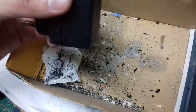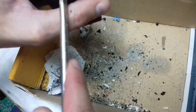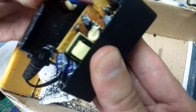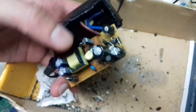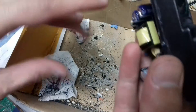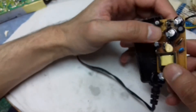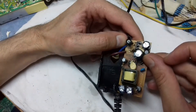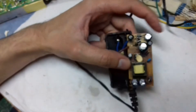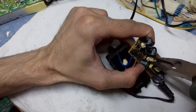As soon as I opened this adapter I could see a part on the PCB board where the color had changed because of the heat. After removing it — they are quite hard to take apart — you can clearly see the area around the main IC where the circuit board has changed color. There is no optocoupler or any other circuit, just a few diodes, capacitors, and this IC.